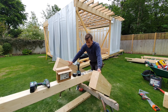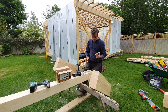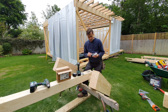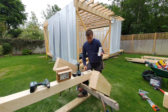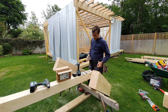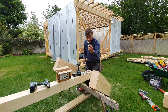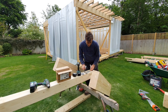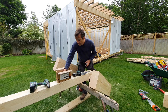I've been asked by viewers how you butt glulam beams together and join them without any fixings on show, hangers or anything like that. So this is a situation where I'm actually going to be using one of these particular contraptions - it's by Simpson and this particular one is an ET160. What it is effectively is like a dovetail that slides together, so the post in this case is routed out to receive that section.